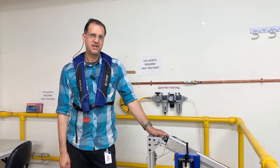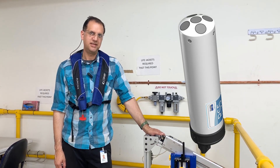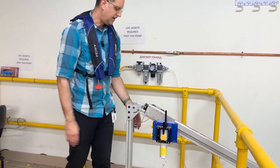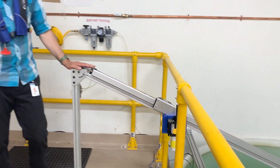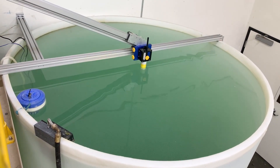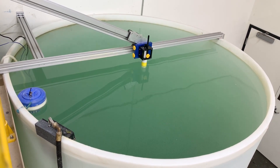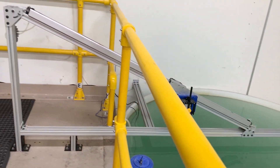Here we have our newest fixture for our RS-5 product line. This is a test fixture that we can test the RS-5s in-house. We install the instrument to the fixture, and then we send it down into the water using this pneumatic system. It's as easy as pulling a lever — it places the unit directly in the center of the tank, and we're able to collect data for our RS-5 systems. When we're all done, we pull it straight back up using the pneumatic actuator.